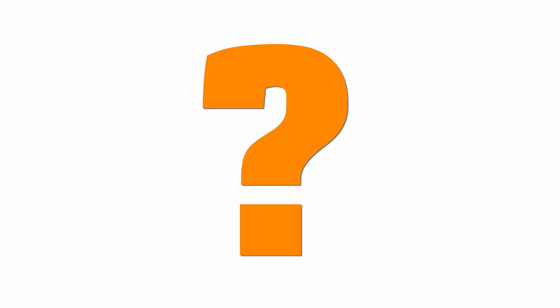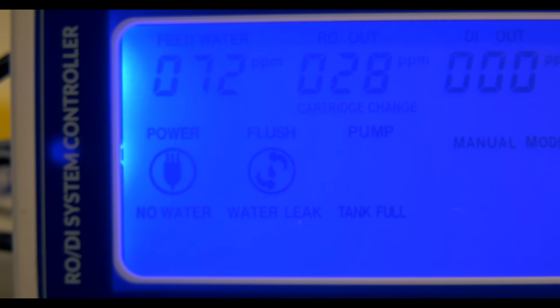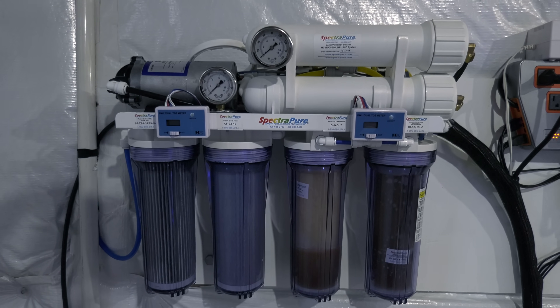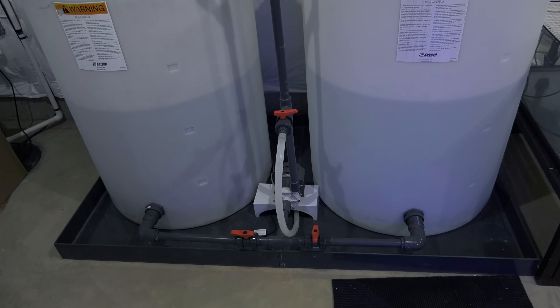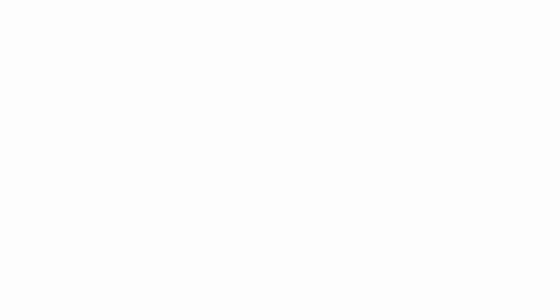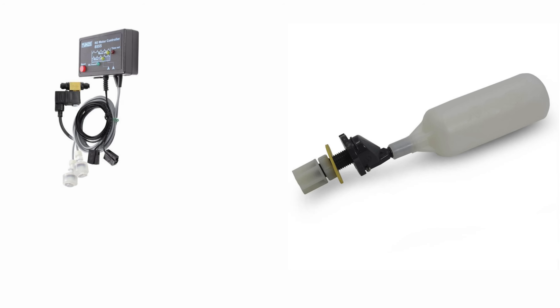I didn't find an add-on to automatically flush your RO membrane without using a controller, so your RODI unit will have to have this feature built in, like this IceCap unit. No more forgetting to close your manual flush valve and wasting a bunch of water, as this unit takes care of the flushing for you. I'll also cover a high-end RODI unit in the next episode when I take you through a fully automated, high-tech mixing station I'd build for a client. Since all my tank builds utilize a tank controller, I have the tank controller monitor and control the mixing station. If I wasn't using a tank controller, I would at least have an RODI float switch on the mixing station and add a layer of redundancy with a low-tech water control system.